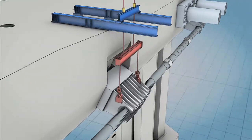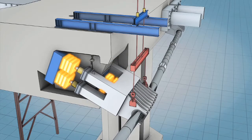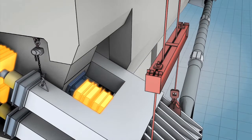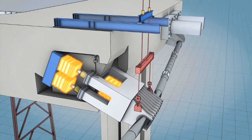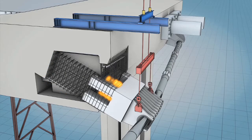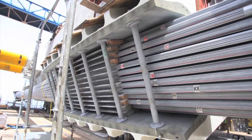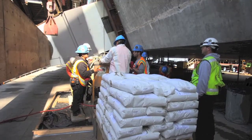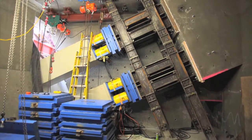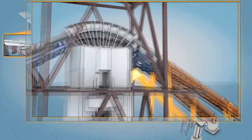Now we're at the back end of the bridge, and we need the tension to be correct on this part of the cable that's coming around the back end. So we created a jacking saddle here. We have hydraulic jacks pushing against the saddle, and then steel plates put on the inside of that to get the spacing correct so we know we have the right tension on the back end of the bridge. Once we have surveyed it and know that the stresses are correct, we fill the cavity with rebar, grout it with concrete, and this never moves again. There is the back end of the jacking saddle — you can see the cable coming across, the space in between the bridge and the cable, and on the inside, here we have the steel plates stacked up right there, and the hydraulic jacks pushing against the saddle, put in like spacers until we get that correct.